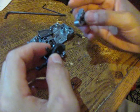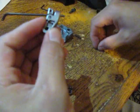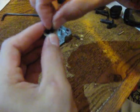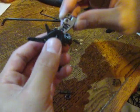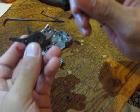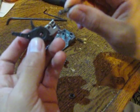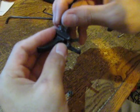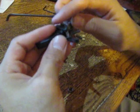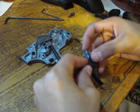Next is the mechanism that releases the hammer. Inside there's a slot, and a spring should already be inside if you didn't mess with it. Turn it over and put it in just like so. Get your pin — short end, the indentation, and long end — hold the long end first, left side up and right side down, then slide in the short end first and let it fall in. There you have the trigger.